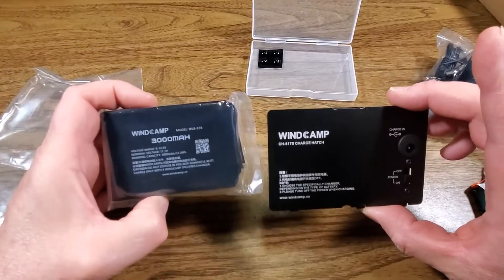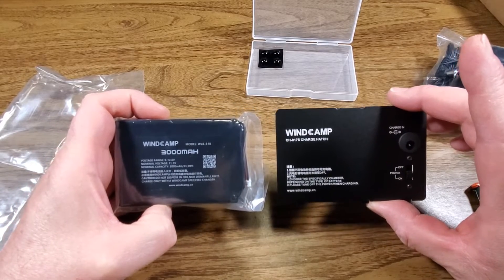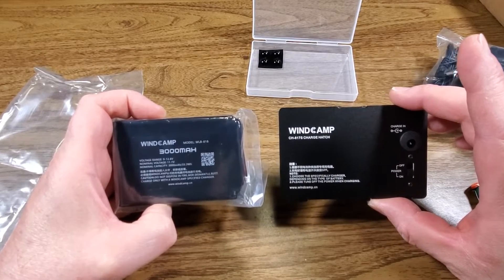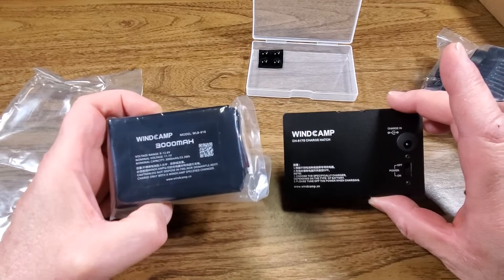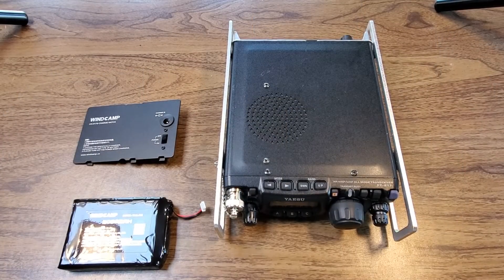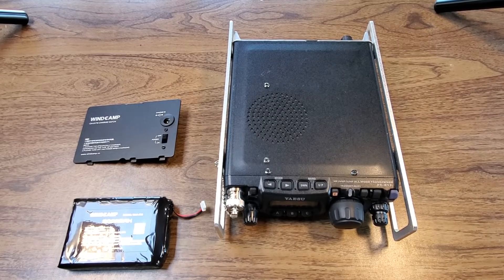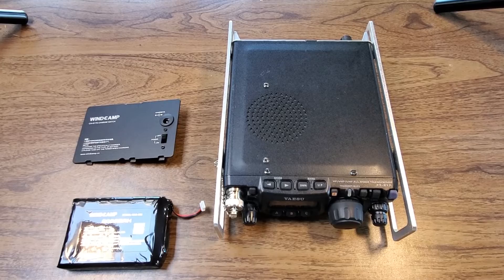I have charged this original battery using my Yaesu FT-817's built-in trickle charge — I had it set at about eight hours — and tested that the radio does run off the battery. All my other use of the FT-817 has been with an external power supply or an external six amp hour LiFePO4 battery. Let's move on to installing the new battery and battery door in my FT-817, charge it up, and see how it works.